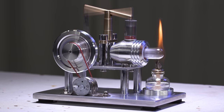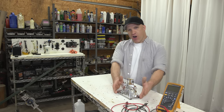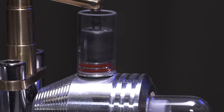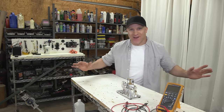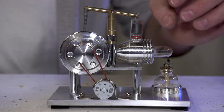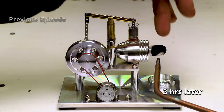As you can see, this engine is pretty cool — it functions perfectly, it runs, it's a real engine. In my opinion, this is an awesome little engine for the price because it's literally a miniature version of the real thing. I think a lot of people would enjoy it, so I put a link in the description below if you want to buy one. The way these Stirling engines work is you have a hot piston, a heat exchanger, and a cold piston. They take the heat created from the flame in the hot cylinder and convert it into rotational force. I did a little video where I ran this engine non-stop for three hours straight.